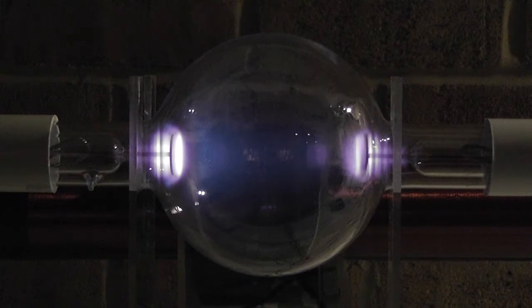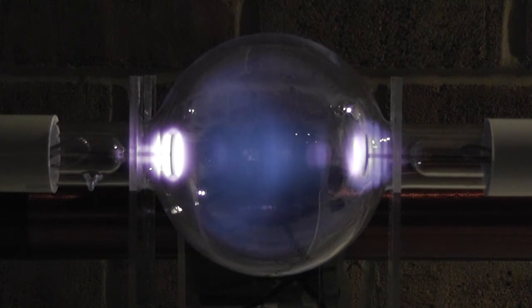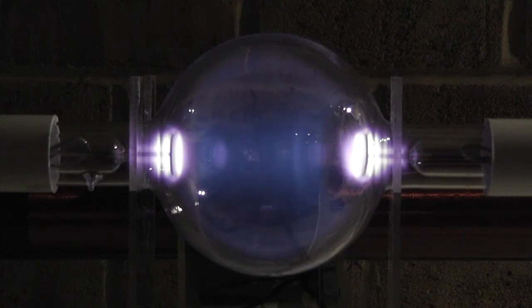It stays but there's not really much going on. Current draw is reduced by 50% at the moment. I'm at 1.32 megacycles. Let's go back to 1.25 — what I had before. Getting closer, getting stronger. You can see the fields expanding from the left hand side. Now it's getting focused in the middle. I get a nice bend now in the middle, until it flips over and stays separated on both sides. Now it moves over to the right hand side.